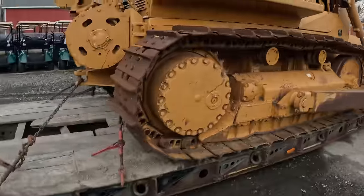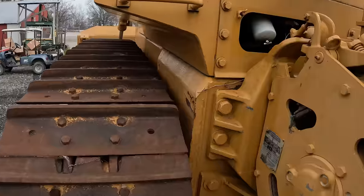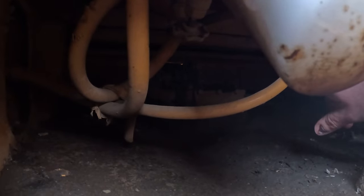So this machine, unfortunately, has an always applied brake. And right now, she's dead. We got to get her off. So I believe we got to get way back in here and get grease in the tow ports on the valve body way back there. And what that'll do is that'll release the brakes for us.